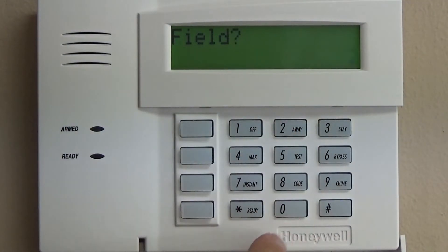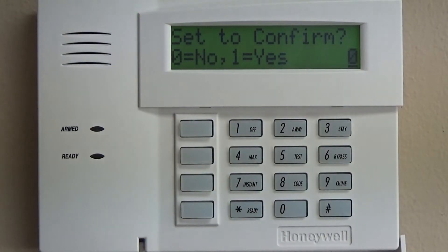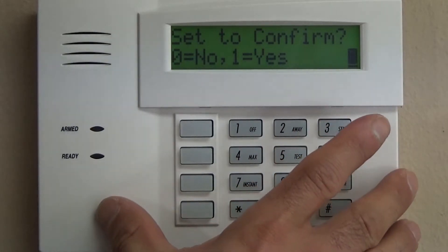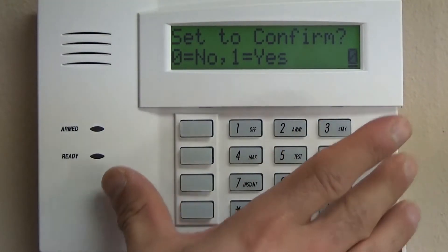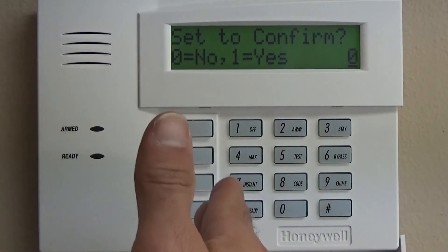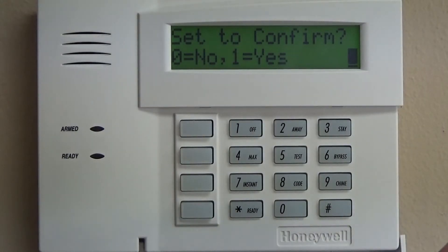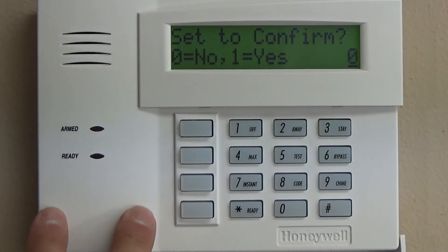So now we can go to star 20 or we can go to star 56 — we can enter back into any of those fields from where we are. After this, we're going to go into programming the actual RF keypad, and I'm going to show you how to program an RF zone as your next step. This will change whether you have eight hardwired zones or 16 hardwired zones, and then you're going to start at zone 17 with your wireless. I'm going to show you how to enable a wireless contact to your 6160 RF and VISTA 20 keypad.